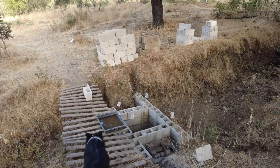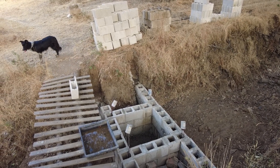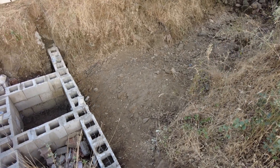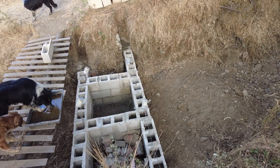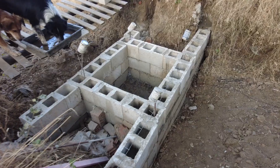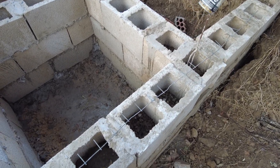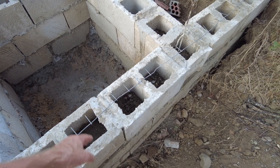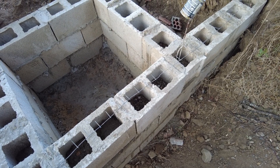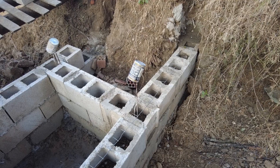We are four blocks high. The first block is completely placed into the concrete. This morning we filled the upstream cells of the cinder blocks with concrete, and I did not fill it to the top, because I must build four more blocks and then pour concrete again so it can key into this one. This is about a third filled, and I didn't want to wait till the end because it might not go down all the way — and I'm pretty adamant that it should.